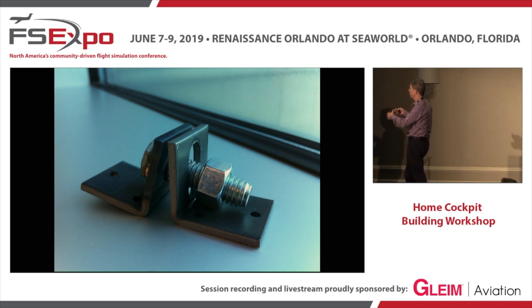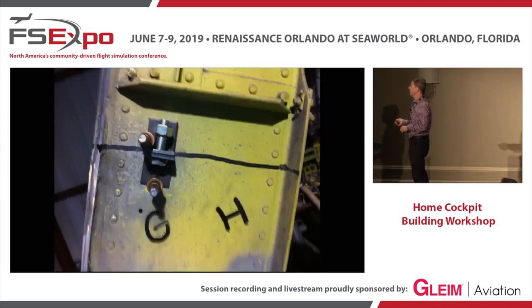So it's welded to the left side bracket. And then there's an eccentric hole on the right side so that you have a way to nudge things one way or the other as you're fitting them back together. And then they punched me some holes in the other side of the bracket and allowed me to rivet onto the airframe. So every time I wanted to make a cut, I would draw the line where I was going to make the cut, and then I would come along and mount with temporary rivets. These are called clecos.